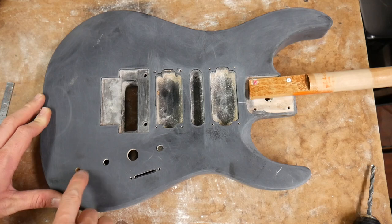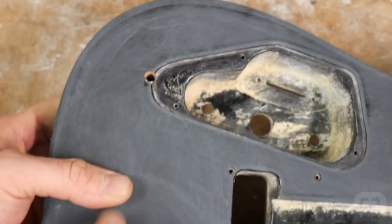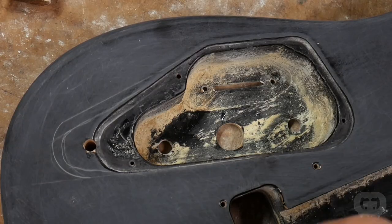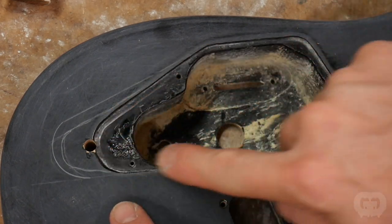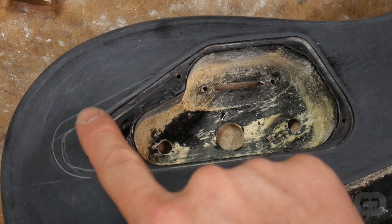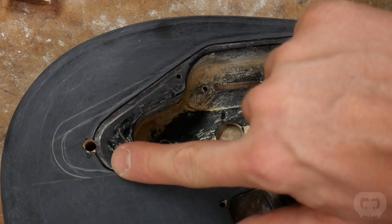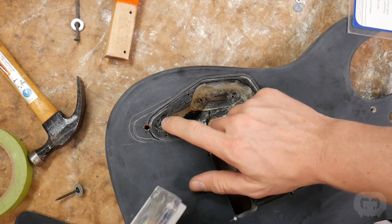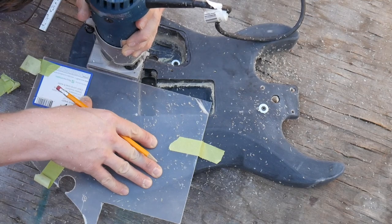Now we have all the holes drilled, including the boost switch hole. But when we flip over the guitar, we find another problem — the hole is outside the guitar's original control cavity. I knew this going in, but I wanted the holes to be precisely evenly spaced, so we're going to extend the cavity over using a router. You can see the cavity has a shelf that's approximately an eighth of an inch deep that goes around the whole perimeter, so that the cover can sit on that and be screwed in. I've drawn some lines that follow the original body lines, extended it around, and traced the original curve from the old cover onto the guitar. Now it's time to bust out the router and start chipping out some wood. The router lets you set the depth automatically, so I'll make my shelf first, then come back and do the deeper routes afterwards.